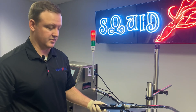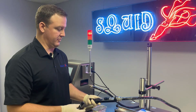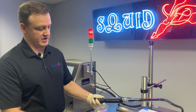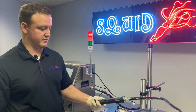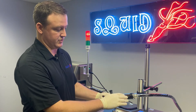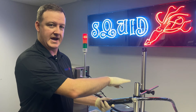Once your back flushing process is complete, if you did remove this inner cover, of course make sure that you put that back on. The system is actively jetting. If you're not comfortable putting this back on while there's an active inkjet, you can always shut the system down. But if you're careful, you can get this on. We'd put those four screws back in and then we're okay to slide the printhead back into the sleeve.